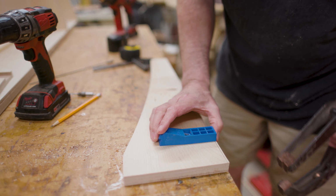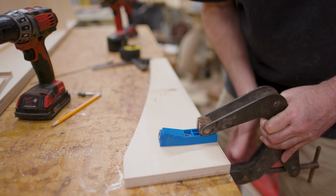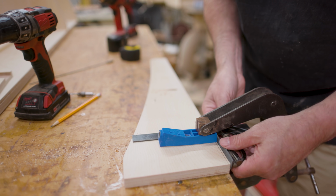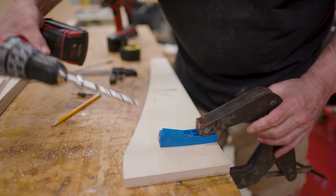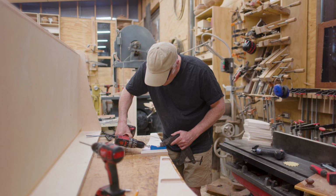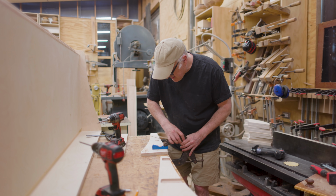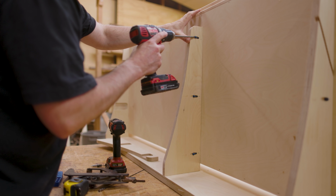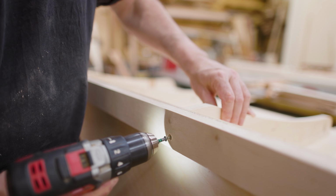For the under the desk supports, I wanted to do these after I had the back panel put on, as I could rest the back of these supports against the back panel, instead of trying to get them all in line without any physical reference. So with the back panel in place, these supports just go into the corner between the underside of the desk and the back panel. And it makes it much harder to screw them up. And this is where having the support of the internal bracing of the torsion box helps, as I can put these screws into those supports.